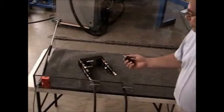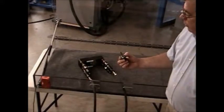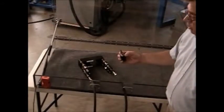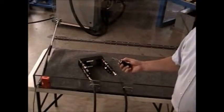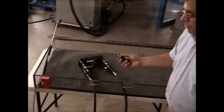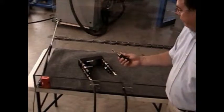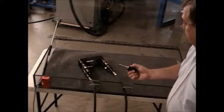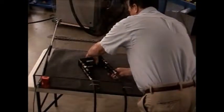As part of our demonstration, I'm going to attach a calibrated leak standard. This is a small stainless steel capillary tube that's been crushed to a leak rate of 100 ounces per year of refrigerant R22. Unfortunately, that's how we create our standards — I don't have the CC per second equivalent, but I will demonstrate the leak later in water. For right now, I'm going to attach it to the A side on one of the quick disconnect fittings.